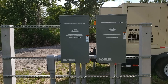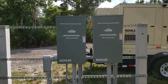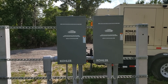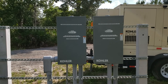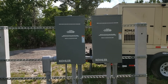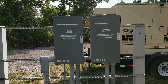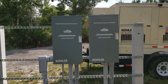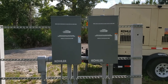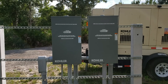So pretty much if we have a power outage and everything's on — we've got a couple air conditioners, our cell tower, stuff like that — what's going to happen is if one transfer switch throws to generator power, you're going to have a very high demand. So basically what we've done is the panel here on the left, that's the main panel. That's going to be the first one to kick in about a minute after we lose power, let the generator warm up. And then the second panel, which pretty much only runs our house, it throws the switch after about two minutes of run time. It's better on the generator, it's better on everything instead of just throwing the whole load in there.